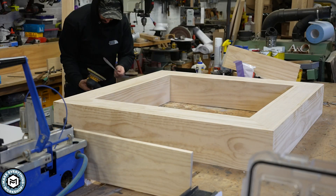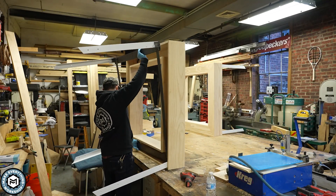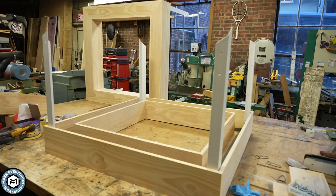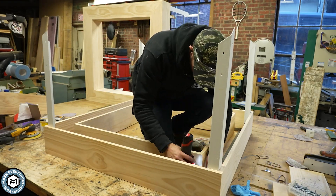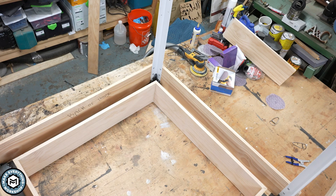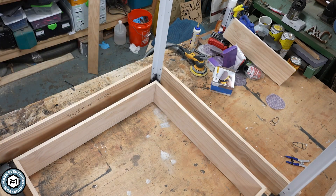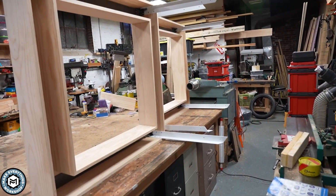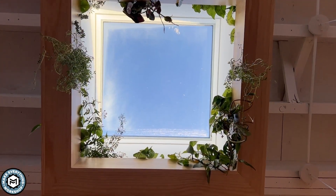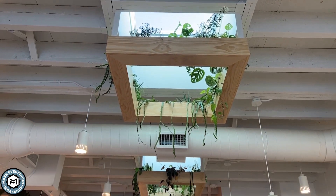So while the wood filler was drying, I could go back into the other room while the paint was drying. Then I could stick these little metal frames inside the box, stand them up, and tip it down onto its side, and add all my screws to mount the framework to the actual planter itself. I put six screws in each piece of angle and they are the absolute longest they could be without poking out the other side. You can see the way those planter boxes fit — they work perfectly. We had these custom made online so that they would be watertight and fit really well. The planters before we brought them over to the restaurant came out really, really nice and look super clean. Then the general contractor mounted them inside the skylight boxes inside the light wells using some structural lag screws, and Chelsea filled them with plants and they came out beautiful. I'm really excited to see this place finished and see how customers react to such a unique item hanging above their heads.